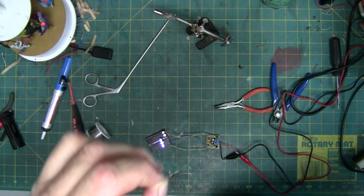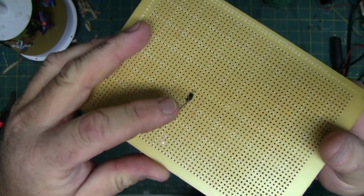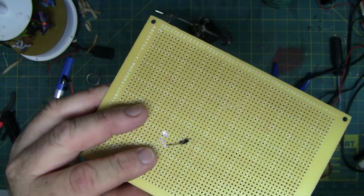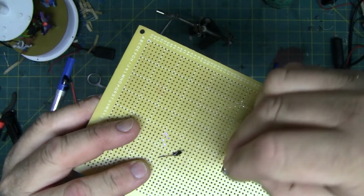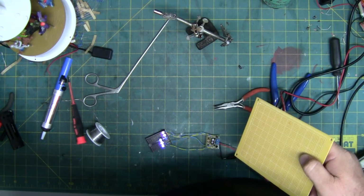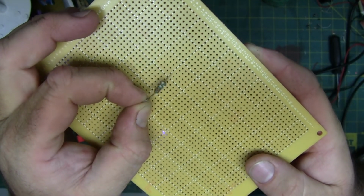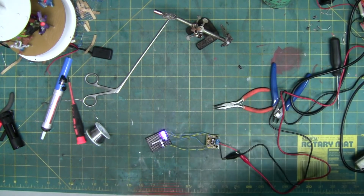Let's see if we can get it to focus. So it has melted through, has no resistance, well, no good resistance. The resistance level on that is like 470 megohm. It's ungodly high. And then this resistor was attached to it as well. This one is also discolored and burnt. Basically every resistor in the top of this unit has been slightly damaged. This one, it started melting the casing. Still a good resistor as far as it functions, but because it has damage, it's going to shorten its lifespan. So they're all getting replaced, like I mentioned earlier. But I wanted you to see, since I've cut them all out and replaced them.